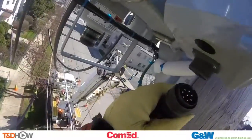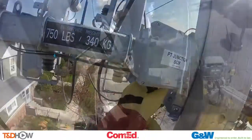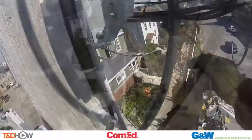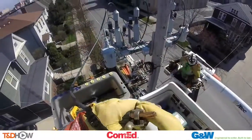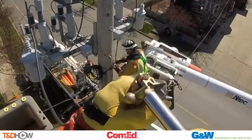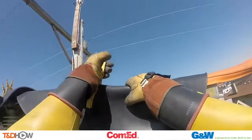Now hooking up a control cable that goes to the potential transformer, hooking up the control cable, and now connecting the ground from the recloser to the pole ground. And here creating power taps — line taps that go from the jumper onto the phase itself.